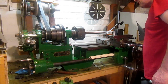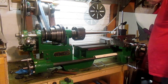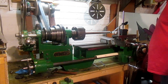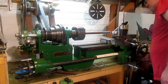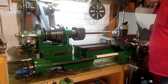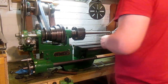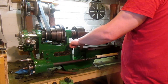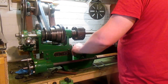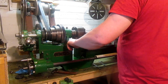That's 0.1 of a mil. That's as far as we can come. Oh yeah, 1/15 of a mil. So that means I want to push that end over, doesn't it? And I better undo them bolts. I see a bit of movement on there as it is.